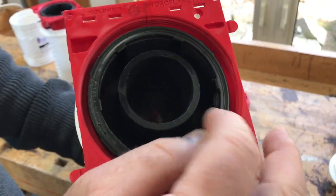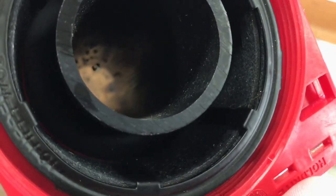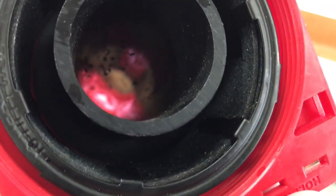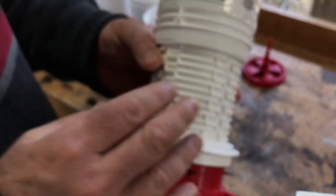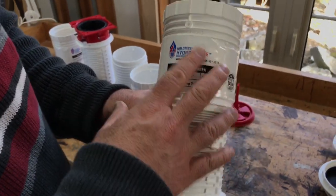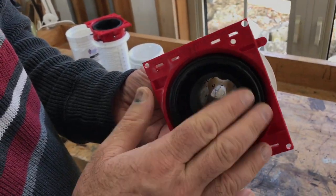Here's the pipe, and if you look around this black ring here, you'll see a substance around the side — that's an intumescent banding. Intumescent refers to the ability of something to swell in the presence of heat and flames. The idea is that that banding, when sufficiently heated, will not only not burn but will expand, and if necessary — if this pipe burns away — it will seal the hole opening, preventing damage and even fatalities in higher levels. Normally, intumescent materials need to be added to an ordinary pipe penetration separately; they come in caulking tubes and materials that can be stuffed in. But the intumescent material is included in this product.